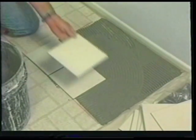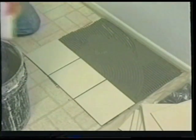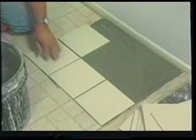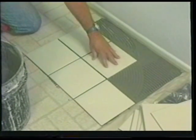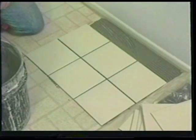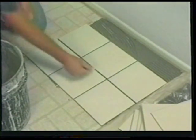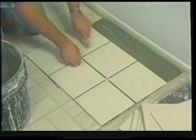Place your next three tiles along the chalk line, then the next three tiles. Try to set them approximately one-quarter inch apart and as straight as possible. When these tiles are set, begin placing in your cross spacers. Make sure the tiles are seated properly and that each spacer is pressed into the mortar. Some people may want to leave the spacers in and grout over them. If you need to remove them, use an ice pick when the floor is set properly.